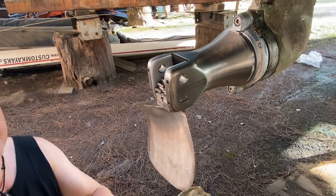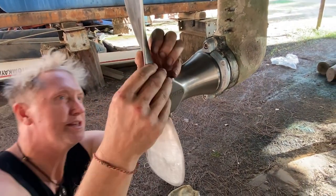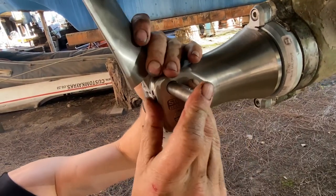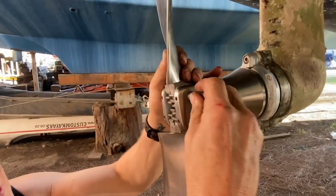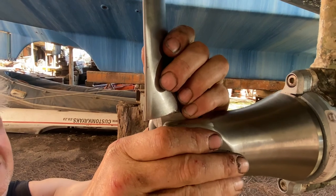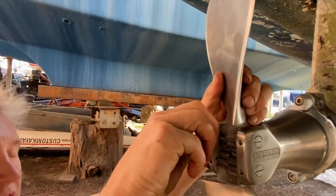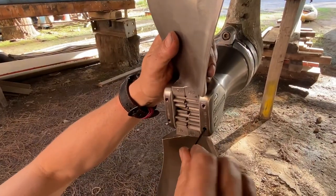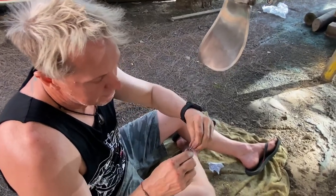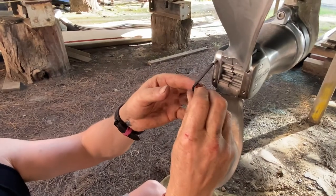Get the other blade on — make sure we're in the right position. Don't have it down when we put it in; get it up to the right position. That blade's up, that blade's up. And the other pivot pin — let's try and make it a bit symmetrical, let's have both of the alignment lines in the same spot. Large grub screw, without Loctite again. We've got grub screws in place. Let's finalize with the other two large grub screws, and the final ones are the little grub screws, which require Loctite — and that holds the first grub screw in place.